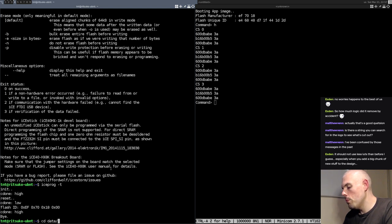And I know that for the hyper-RAM controller, at least 400 LUTs are used just for the high-speed serializer and deserializer, because I need to replicate a bunch of logic so that it's close enough to the I/O pins to be able to run them at high speeds, basically. So yeah, the cache and the hyper-RAM controller is like 1,000 LUTs, which I think is decent for the functionality it would provide.